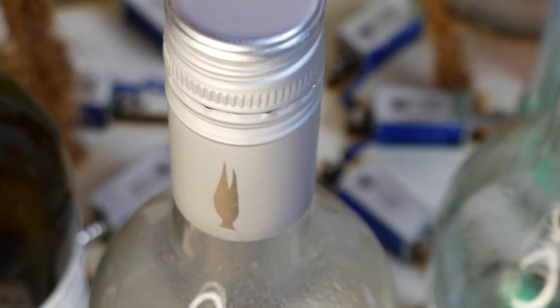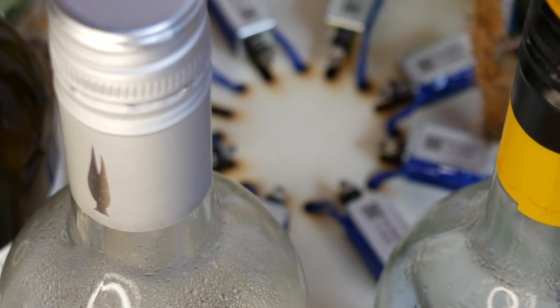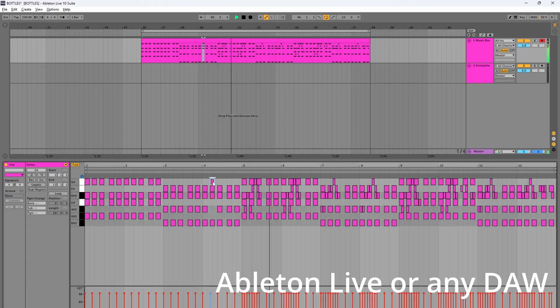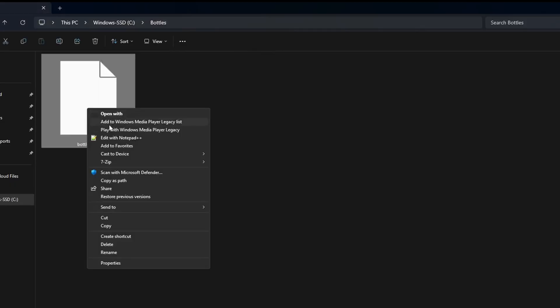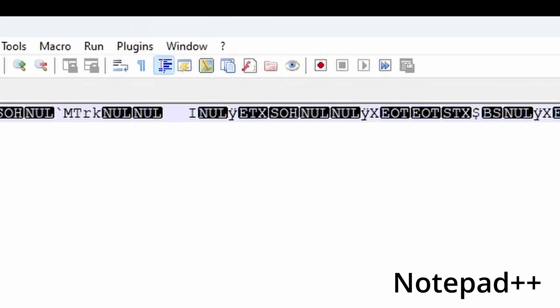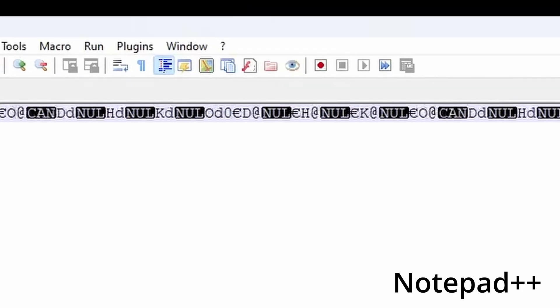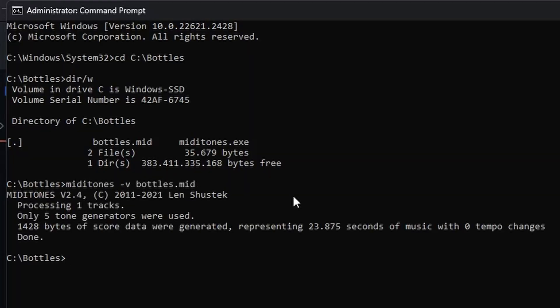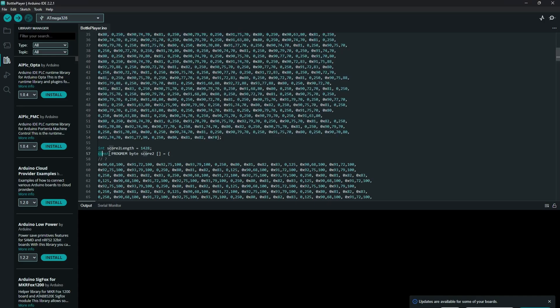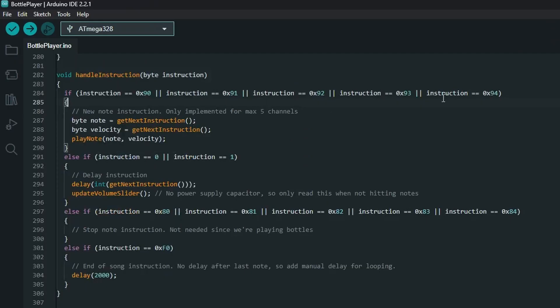Let's take a break and look at how we get the MIDI notes actually playing on this thing. We start out with the song — just a bunch of notes and timings — and the computer plays these notes for us. We export the song data and get an unreadable binary file, which doesn't really help us without any way for the Arduino to read it. That's where the MIDI tones application comes in. It converts MIDI files to a simplified time-ordered sequence of note commands, and we can copy these into the Arduino. Then I built a parser for the Arduino. If you want to see the full code, there's a link in the description.